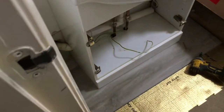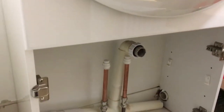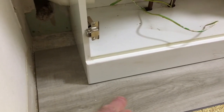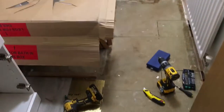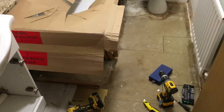I did get the vanity unit fitted, which was a great pain, just the way the pipes were configured. The only way I could run the pipes is actually through the base of the vanity unit. I still need to reconnect all this waste here — I was waiting until I got the first section of flooring under. I was going to take all this out, floor the bathroom, and then put this back in, but I don't want a brand new floor down when I'm in here with the wet wall panels fitting the bath. I just want to leave this off and do the floor last.